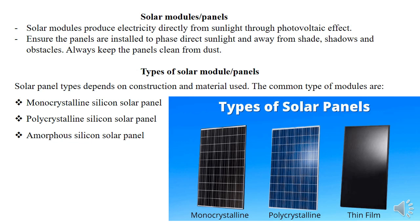With the solar modules, we have three types. The first two are the most common that we use, but the third one we use for smaller appliances like lanterns and solar mobiles. The first two which are most common are monocrystalline solar panels and polycrystalline solar panels. The difference is on the alignment of the cells — monocrystalline is very dark while polycrystalline is usually blue. The polycrystalline cell is a perfect square, but the monocrystalline is usually in a hexagon-like pattern.